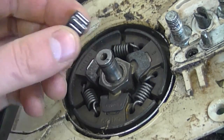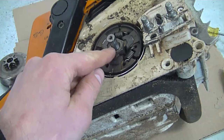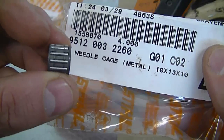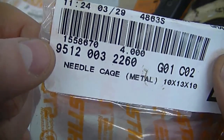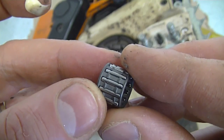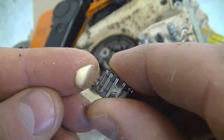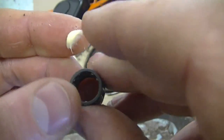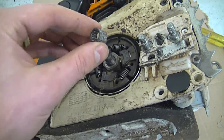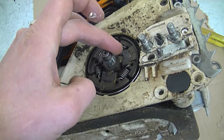Now just remove the roller bearing. The reason I'm replacing this bearing is because there is a bit of play when the clutch sprocket is on. If you're going to replace the sprocket, you might as well replace the bearing as well. I have a new needle cage bearing — part number 9512-003-2260 from Stihl. Before I install the needle cage bearing, I like to put a bit of lithium grease on it — not much, just a little bit. You can also put a little bit inside as well, then stick it on the shaft. You don't want to put too much grease because it can get in the clutch and cause slippage.